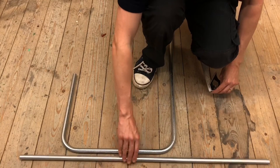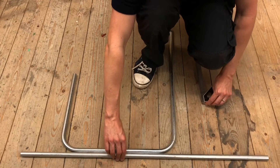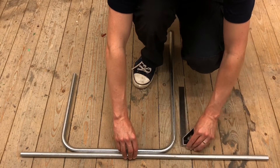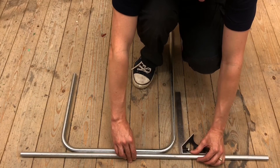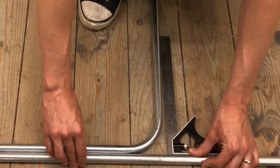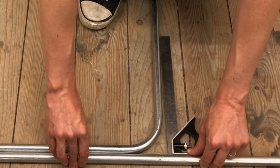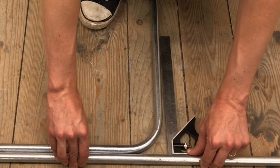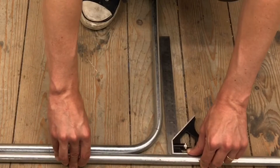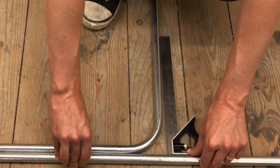Using a scrap piece of conduit to extend the back edge, and then placing a combi square at the end, it's clear the conduit has not quite been bent to 90 degrees — a little more bend is needed. Joe confirms his preference for underbending: it's easier to add more bend than to take it out, so slightly underbent is the desired starting point.